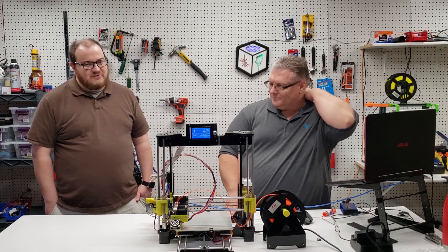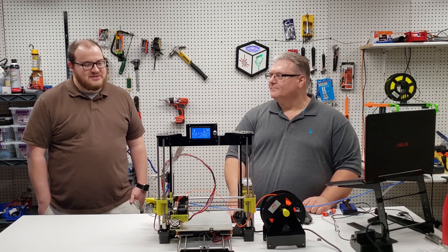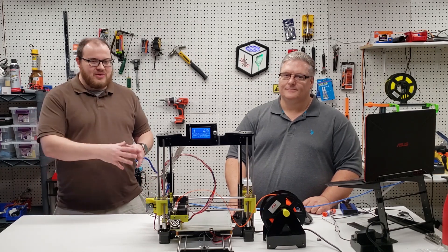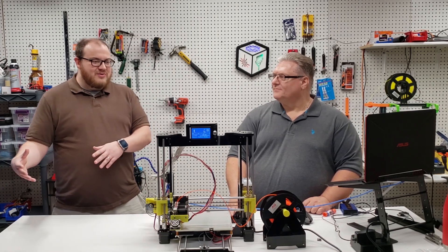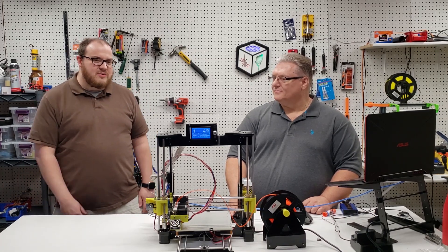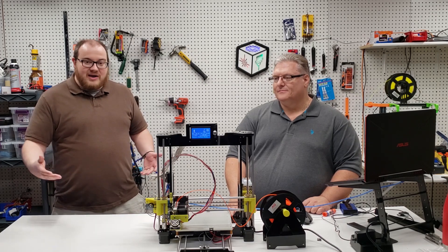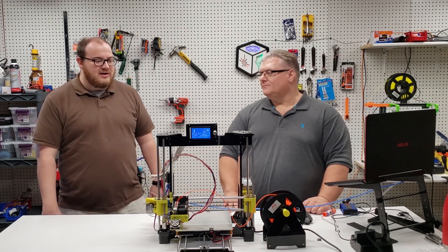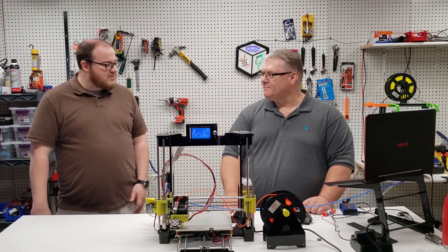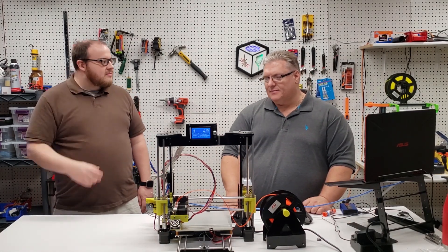For an out-of-the-box experience, especially with the firmware it comes with, there's potential it didn't have thermal runaway protection or any of that safety stuff. Feature-wise it was missing a lot of things. It came with Marlin 1.0 Release Candidate — we've now put 1.1.9 on it, which has way more functionality. It'll probably make this printer 100 times better than it would have been for the original $400 two years ago. Burning the bootloader isn't too hard — you can buy cheap Arduino boards and go.